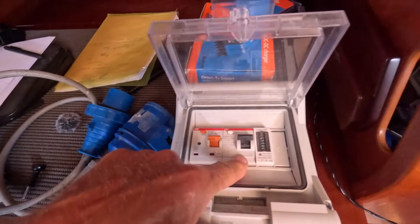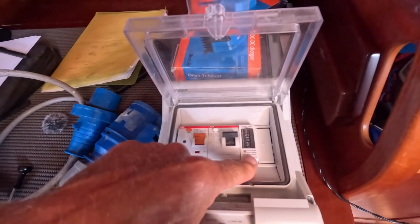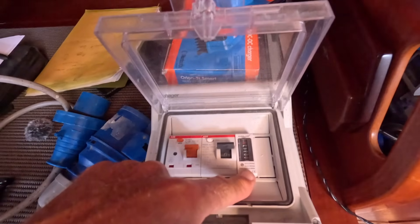That will protect you and your family on your boat. This type of box, if you make one and have it all plugged in, it could save your life. I heard of one Amel that burnt down because the actual marina was hit by lightning and it blew out the fan that was on board. The fan caught fire because of an arc. An arc fault detector could have saved that boat, and it could save your boat too.